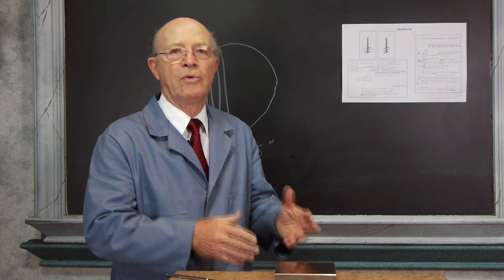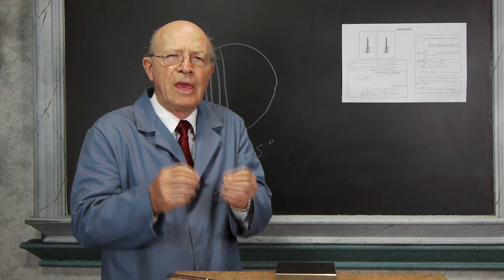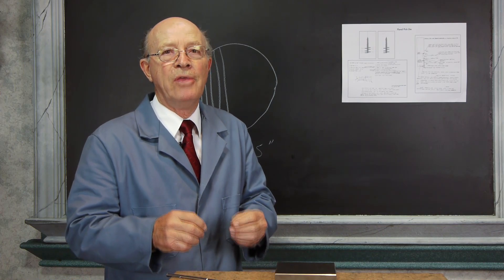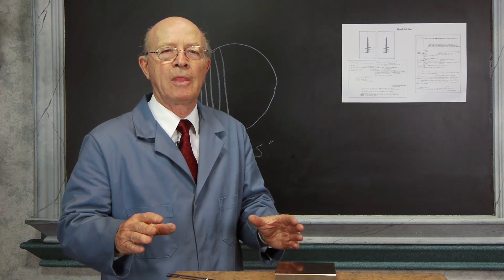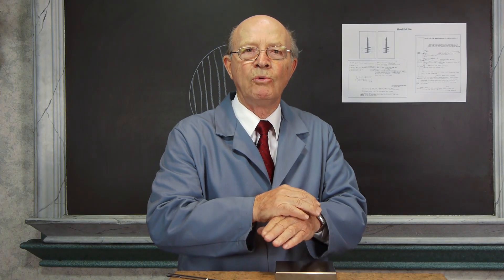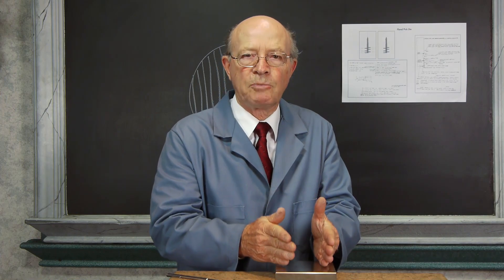I've explained old-fashioned die making from filing machines and hand files, and precision form grinding where we spent days and days grinding on the machine, being very, very careful not to make one little mistake — because one little notch in a punch or die and it would be scrapped. You had to start over. It was very tedious work. Then came the great revolution that really dramatically altered tool and die making: wire EDM was introduced. Now with a simple hole into a part we thread the wire and cut within plus or minus one-tenth of a thousandth, just by means of a computer, and it would program the shape.